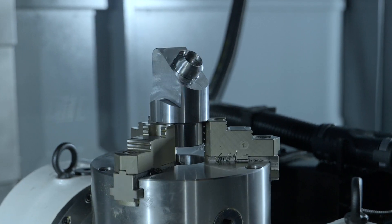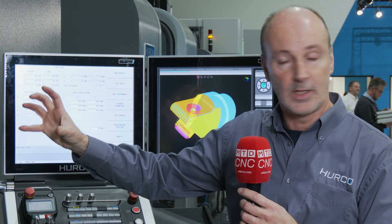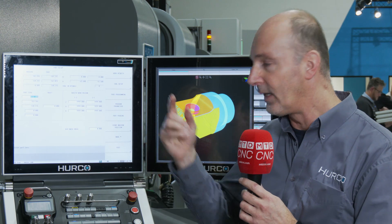So what do you do then — you set your datum points? Yeah, you set a datum. The datum point can be anywhere on the table because it's got the ability to track the datum when it turns the part. So the part doesn't always have to be in the centre — no, it can be anywhere.